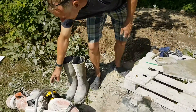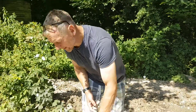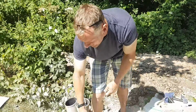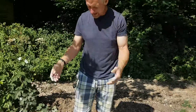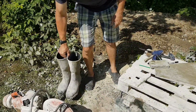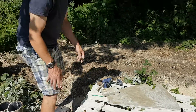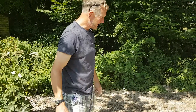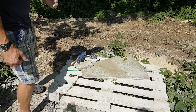A bit of health and safety: ear protection — essential. Every time I stop a cut and switch the saw off, I hang the ears on there so I remember to put them on every time. Eye protection — essential, obviously. I put wellies on because all the debris that fires back gives you white legs all the way up, and you're working with water. Get yourself a pair if you're doing a lot of cuts, otherwise you end up with soaking wet feet and mud everywhere.